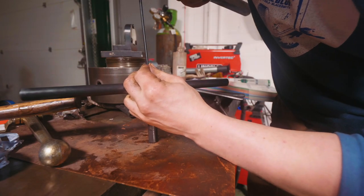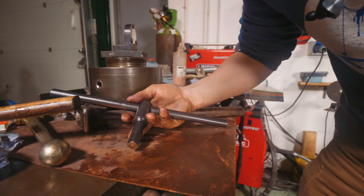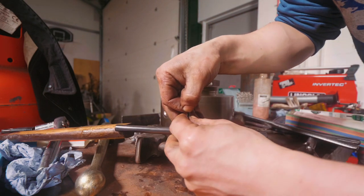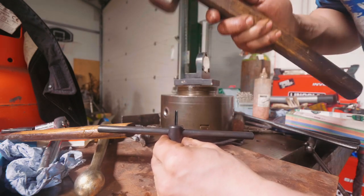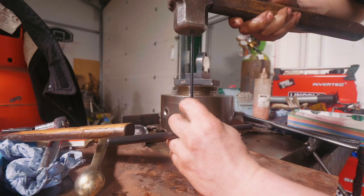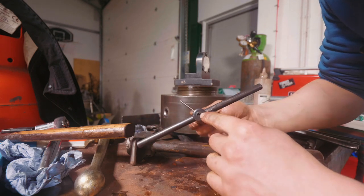I'm a little embarrassed, but I should explain what just happened. This morning when measuring my split pins to use as the fastening mechanism, I saw they were four and a half millimetres. I said to myself, that's fantastic — I bet it's designed for a four millimetre hole, because it's split and I figured it tightens up when you hammer it in. I proceeded to try hammering it in for final assembly and it didn't go well. I even tried the press, thinking maybe it just takes a lot of pressure — and then I bent it under the hydraulic press. So I begrudgingly took to Google, which frankly I should have done earlier, and discovered the correct clearance isn't half a millimetre — it's more like 0.2 of a millimetre. So they are 4.5 millimetre split pins and I've now drilled a 4.3 millimetre hole.